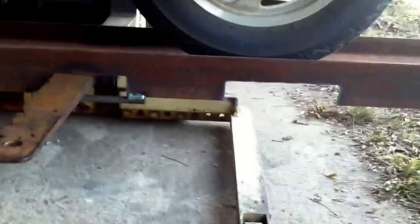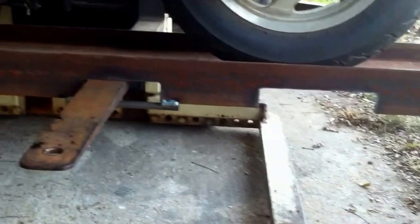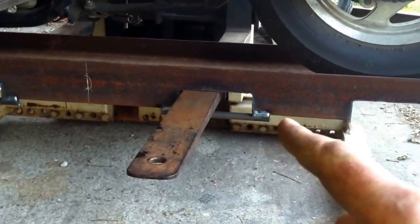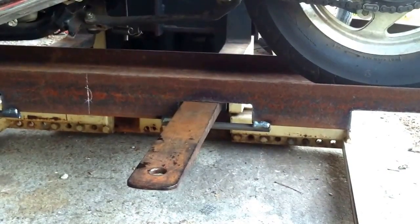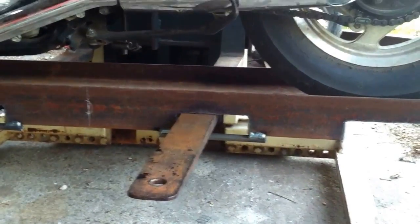I just took a torch and cut this, bent that down to make a little ramp, and cut off the angle there. Moving forward, I have a cutout right here and that is to clear these legs. Right here I have the cutout for a fork, and underneath that cutout I used a piece of 5/8-inch rod to go underneath to keep it from tilting over — it'll kind of catch it and keep it from coming off there.